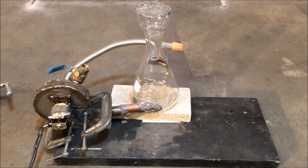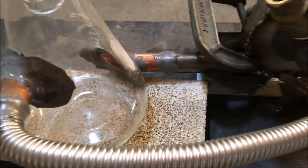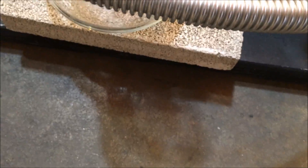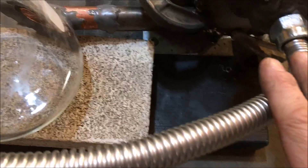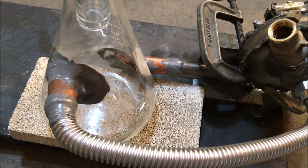What we're looking at here is a cyclone gasification design that I wanted to test out. I decided to take a strong right turn for just a little while, and I'm curious as to whether or not this process will work the way I think it might. Basically, what's going to happen is we are going to modulate the intake air with this valve, and the gases will be circulated in the system. Down there is the discharge tube which will swirl the fuel, and this is the return line which recycles gases. At the top here is the discharge — this here is just a burner diffuser — and I'm hoping to see if we can get some combustible gas out of this.